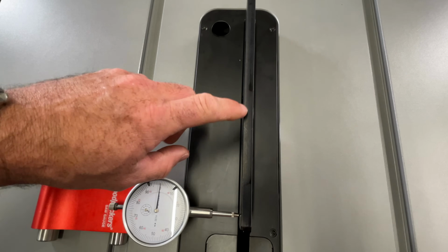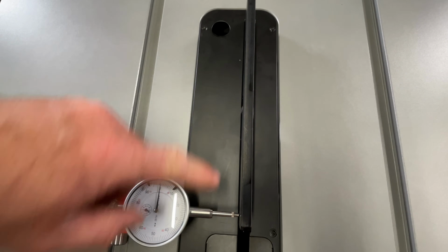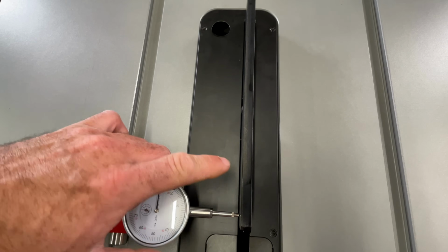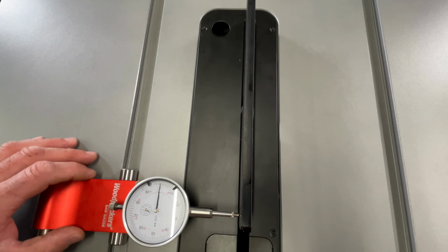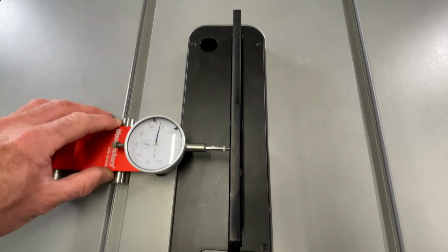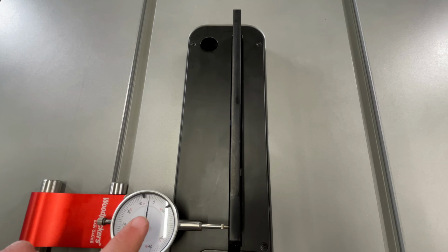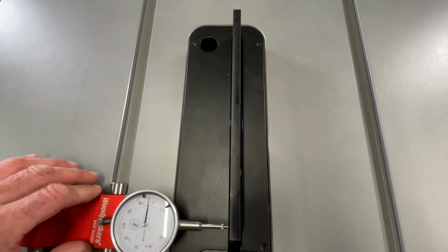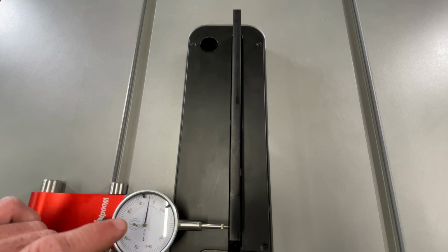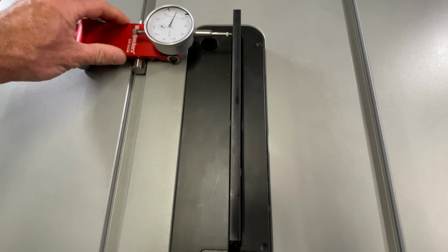So we've got our MasterGage plate installed, saw gauge, of course. I was able to install this horizontally this time because this saw is large enough. If I loosened the riving knife, I was able to squeeze this in there. We got it zeroed out. About 3.5 thousandths, maybe 4. Just under 4 thousandths off. Right back to 0.